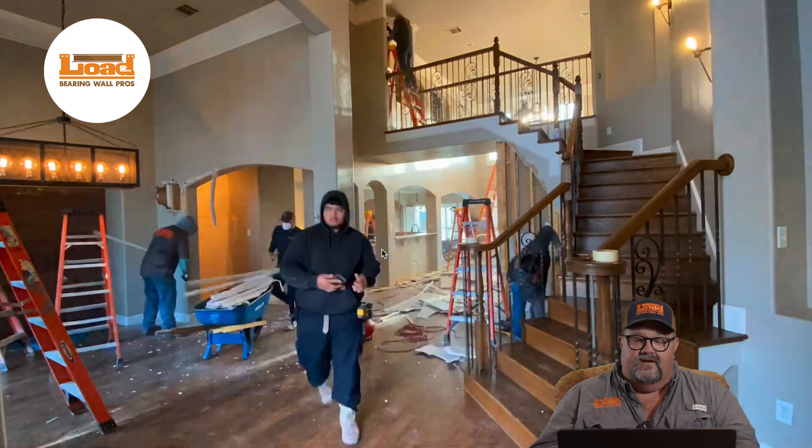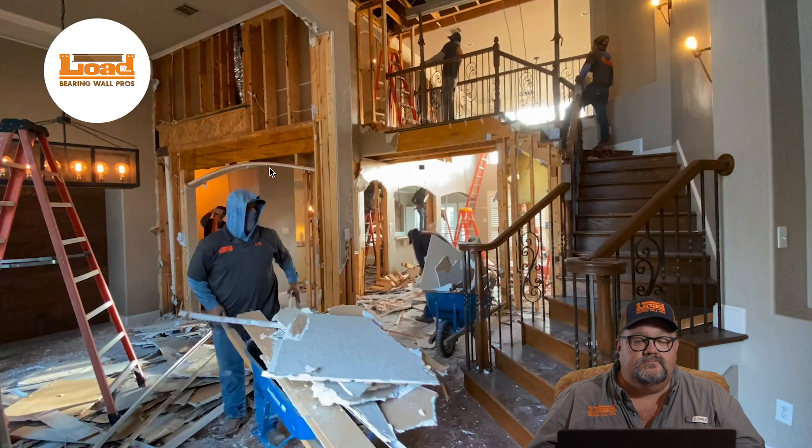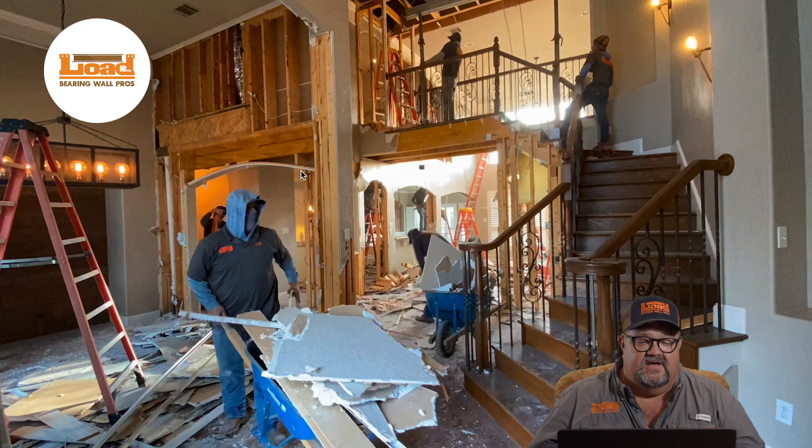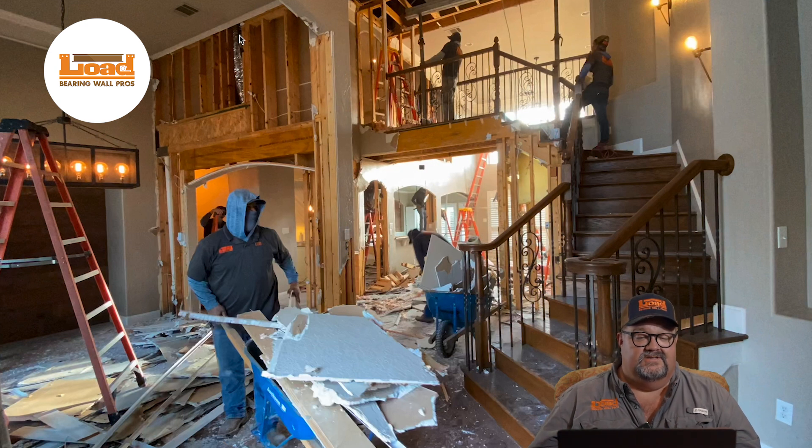So we start off going up and down the stairs a few times and we're removing some sheetrock here. Now, one thing you can see right here is a lot of people think that arches are load-bearing. But the arch is actually made out of this cosmetic material. You can see there are voids on either side of the arch — it's just a straight header straight across. All arches were born as square openings and then converted into arched openings. That's just a cosmetic element. We're not in Roman times where we use arcs as structure. This header goes across and supports the load bearing down on it, and that load is transferred from the header onto the jack studs on either side and down to the foundation. So that arch was at one point square.